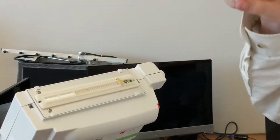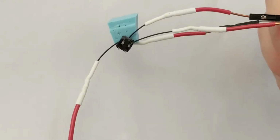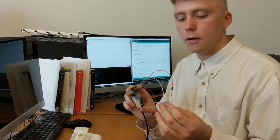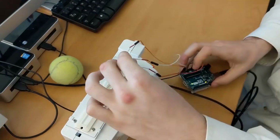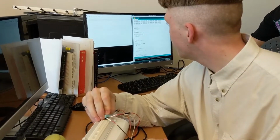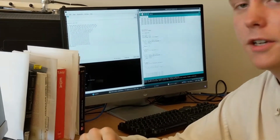Awesome. So now that we know this, we can go ahead and try to read the data out of it. We can now rig up a microcontroller with the 4 pins that correspond to the contacts here to read out the data using commands from the Atmel datasheet. So if we go ahead and just put this on here and run a bit of C++ code that we have written on the computer, we should be able to get a hex dump of the EEPROM. So go ahead and upload this, and contents verified, page match.